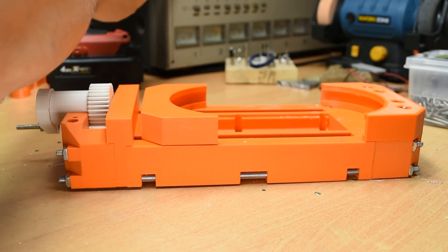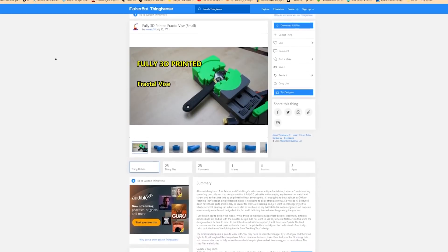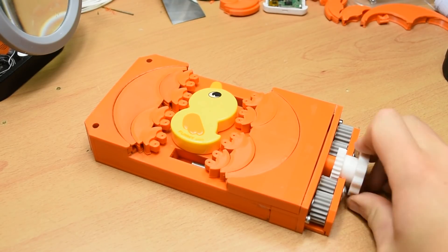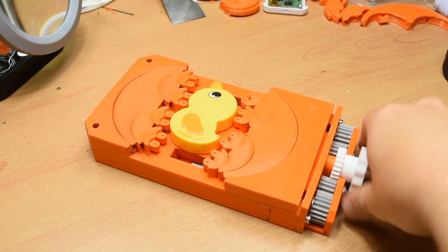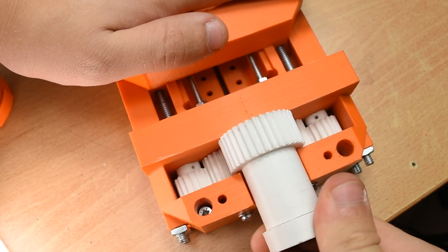If this hardware is something you don't want to deal with, then perhaps check out one of the fully 3D printed designs out there, like this one from Tomato Lab, linked in the description. The gearbox has also been upgraded. The previous version had the opposite of what you wanted, with one turn of the crank being less than one turn of the jaws. In this version, one turn of the handle is four turns of the lead screws, so much faster to use.